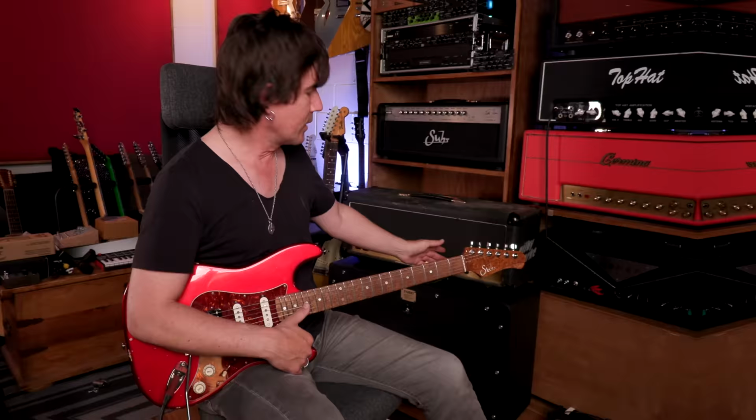So what you tend to do is turn the preamp all the way up a lot of times, right on 10, to get some level of rock gain or rock tone out of it. But when you do that, you completely mix the bright cap out of the circuit that's on that volume pot. It's got a bright cap on it. I've talked about this a lot before in my videos. I don't want to bore anybody out there. But what the bright cap does is it basically lets a bunch of signal above a certain frequency through the pot, whether it's on one or two or three, all that top end is still getting through.